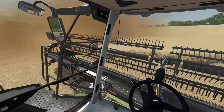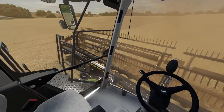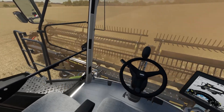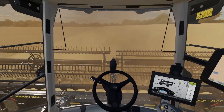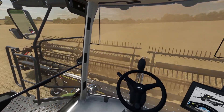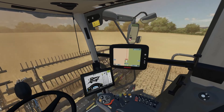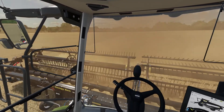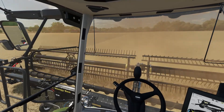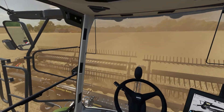Nice clean stubble again. It's a nice simple header with lots of mechanical components. To be fair, you probably don't need the top auger in cereal crops - it's an optional extra. It's certainly a big help in the oilseed rape, just keeping the crop down. You can see we've got a lot more reel travel there, though we're not really using it much as it's a perfectly standing crop. The forward speed is just letting it fall in by itself.